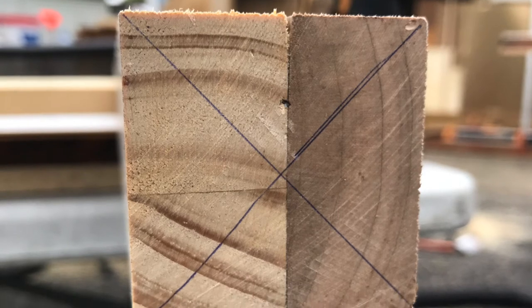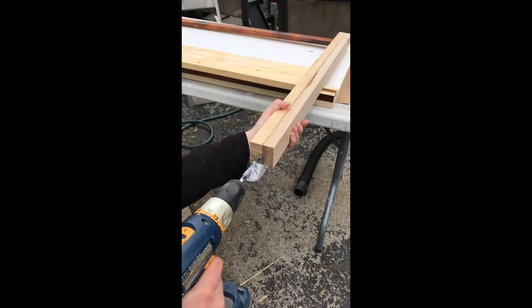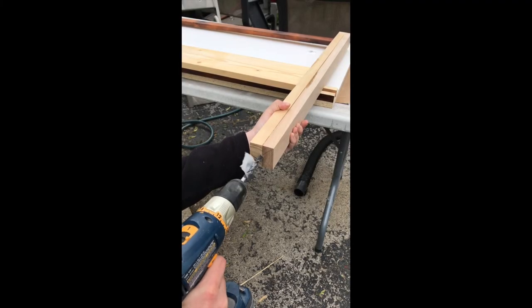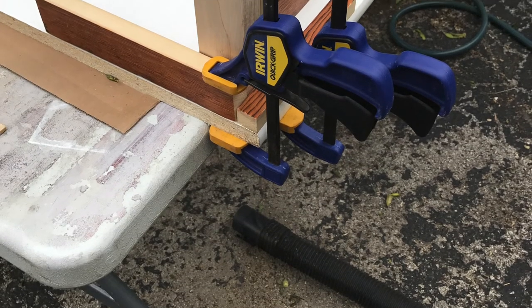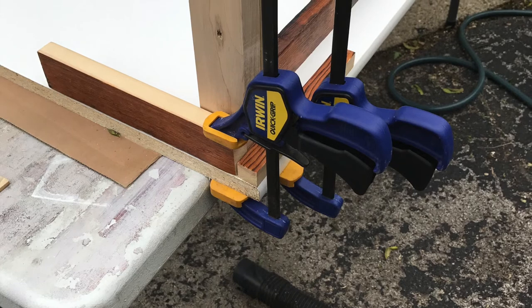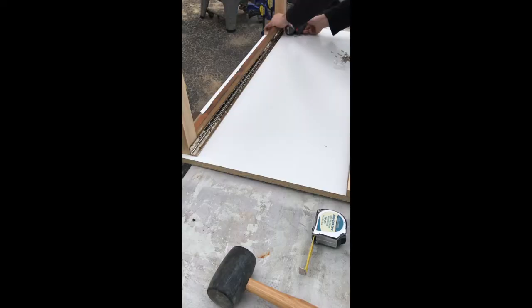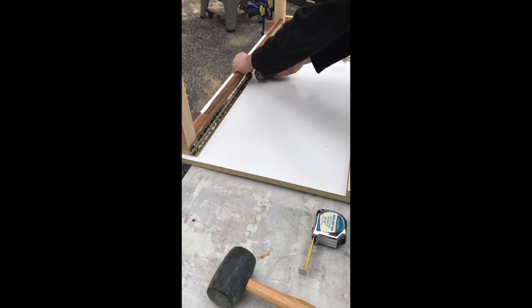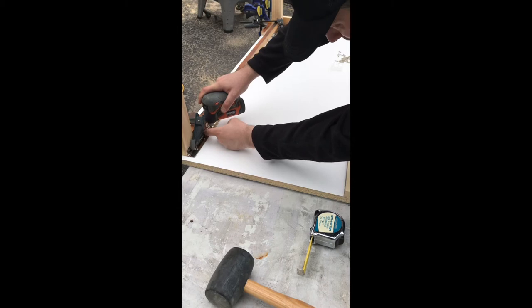I needed to find the center of my legs to know where to drill for the adjustable feet. I drew an X to find my point, grabbed a brad bit with a depth flag, tapped in the insert, and screwed in the feet. With the legs and runners assembled, it was time to attach them to the bottom of the table — I added a spacer, clamped it in place, slid the leg assembly over so it was even on both sides, then added the piano hinge, first screwing it into the leg assembly and then down to the table.